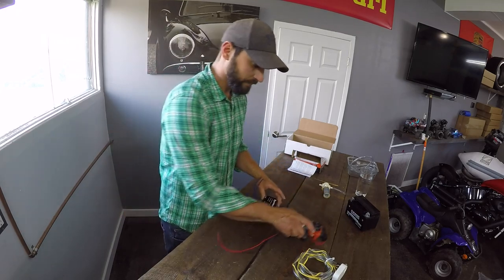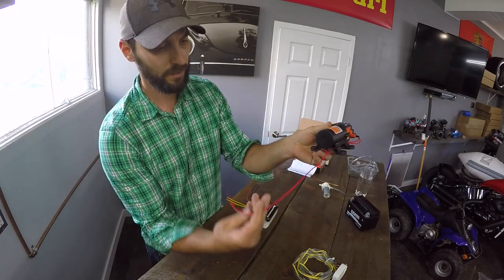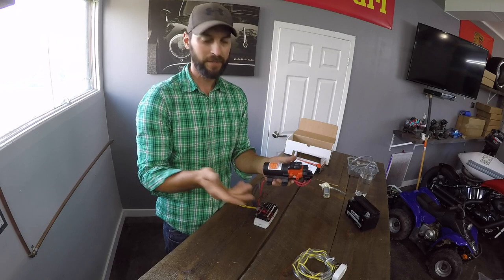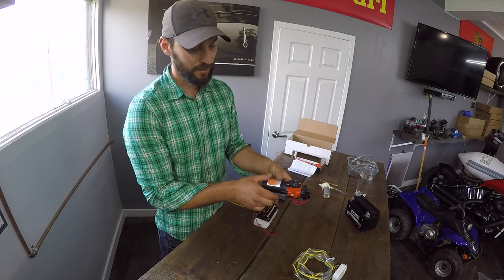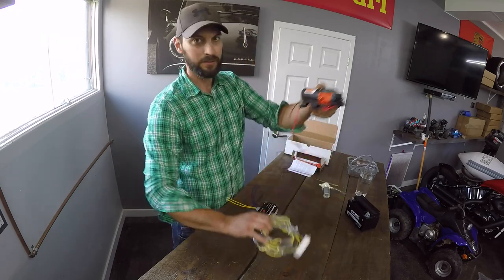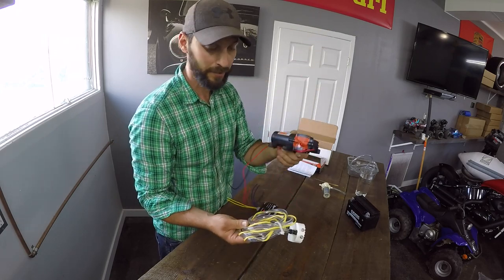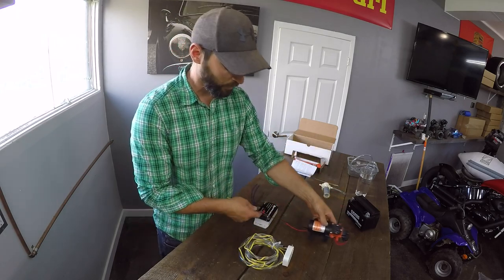Let's hook up our pump. It's a simple little pump and here are our two leads. This pump can actually suck up to six feet — the manufacturer recommends four feet, but we've tested it and it'll do six feet quite easily. That means it's not the distance from the pickup block to the pump, but the height. So you don't want to mount this twelve feet up and try to suck water twelve feet up to it — four feet and under is quite okay.